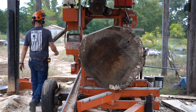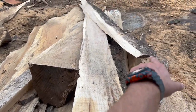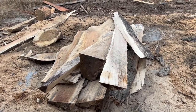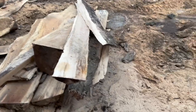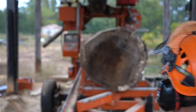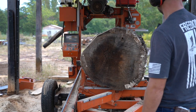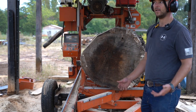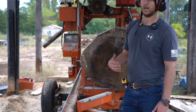The question might arise: is this not kind of wasteful? Yes and no. There is a bit of waste, but if you were doing the live edge method and cutting that big chunk out, you're losing a similar amount. The short answer is you're always going to have waste when you're sawing logs — the goal is to mitigate that waste. Our first slight dilemma: this is not a foolproof, never-use-chainsaw-again method. The real question is how do you not burn your shoulders out cutting an eight by eight inch chunk out of a log that's over 28 inches in diameter.